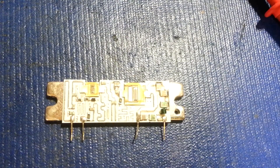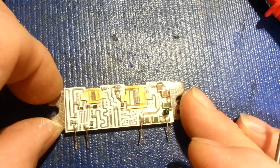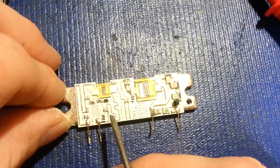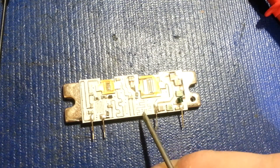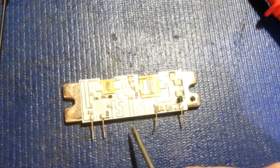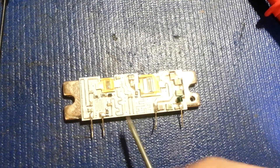Now that we're back in the mount and the camera's not shimmying all over the place — I really wanted to show that under a microscope because it just does not show up. It's almost impossible to see with the naked eye. But it's right there — there's a little crack, almost invisible to the naked eye. And that's the whole problem. It seems to be an ongoing problem with these Toshiba modules — this ceramic substrate breaking.